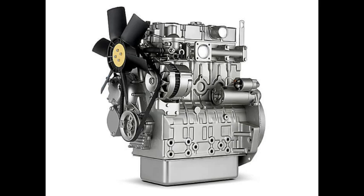It really is. And the manual doesn't stop there. It goes on to explain how to fit the whole piston and connecting rod assembly to the cylinder block. So like the whole shebang. Yeah, the whole thing. You got to carefully align the piston rings, lubricate the bearings, and then tighten those connecting rod nuts to a specific torque. So again, precision is key here. Absolutely. Can't just crank those down willy-nilly. Right. You could really mess things up.